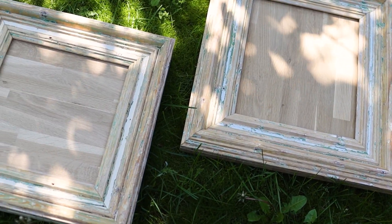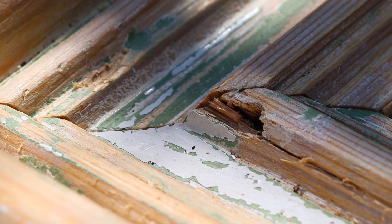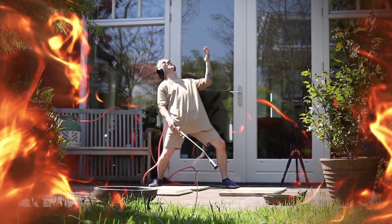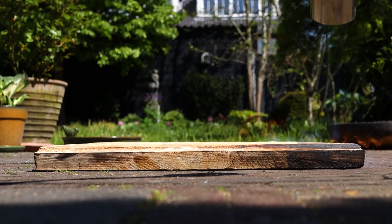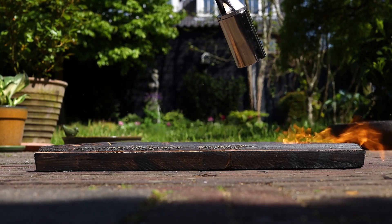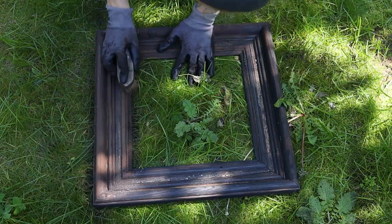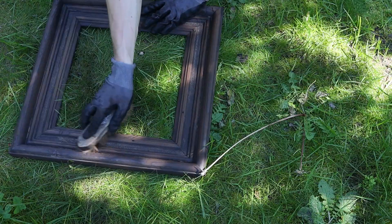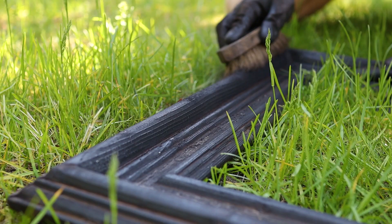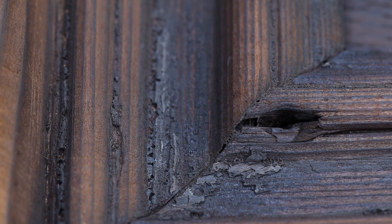It's all slowly starting to come together, but they're still very rough around the edges. So I'm gonna take my sweet time sanding it all smooth. Nope — I'm gonna set them on fire. I got inspired by the Japanese woodworking technique Yakisugi. By slightly charring the surface of the wood, it becomes more durable and fire resistant. I brushed away the charred surface and then decided that it's way too much fun to set things on fire, so I did it again. The best thing about this process must be this beautiful dark color that emerges after brushing away the top layer.